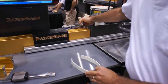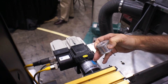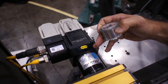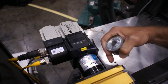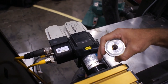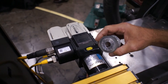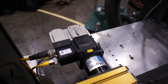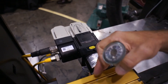The drive pulley is mounted to the gearbox. We use a planetary gearhead — the same kind of gearhead you'll see on high-end machining centers and machine tools. The planetary gearhead has a sun gear and three planet gears around it, so you always have at least three teeth engaged in the pinion gear. Our competition uses a simple spur gear gearbox that's prone to backlash. So mechanically, our components are very sound from the motor all the way through to the carriage.